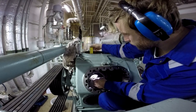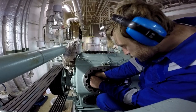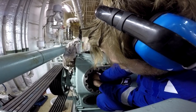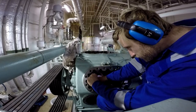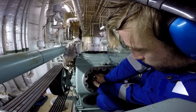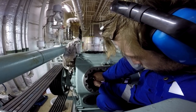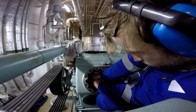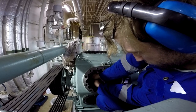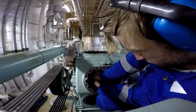And also on the top cover here, that I have in my right hand, there is a rack. If you can see here, there is a rack on the top. There goes one O-ring, which also must be replaced. This is where the top cover goes. Here you can see the procedure of dismantling this unloading equipment. I have made a time lapse and a complete video of the removing of that one and the placement of such equipment, which is the most difficult part.